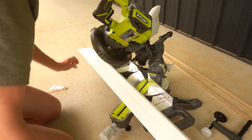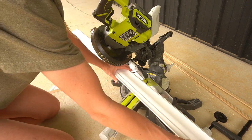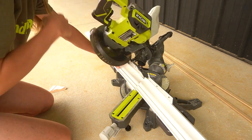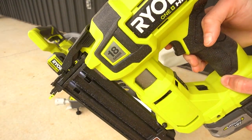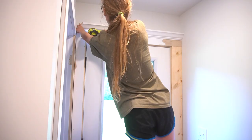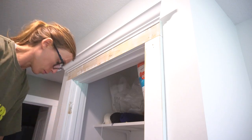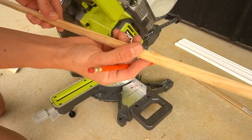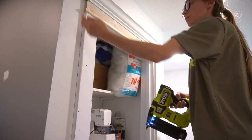This worked perfectly, and actually I think cutting crown molding laying flat may be easier than cutting it standing up. It's nice that these angles are already marked on the gauges so I don't have to remember them. You do need to pay close attention to the direction of the cut and swap mitering left or right as needed based on whether you're cutting an inside or outside corner. After the crown was cut, I swapped from the finish nailer to the Ryobi Airstrike 18-gauge brad nailer, since brad nails are smaller and less likely to split delicate pieces like crown molding. For more details on installing door and window trim, check out my more in-depth video linked in the description.